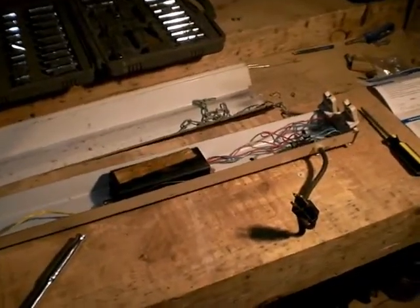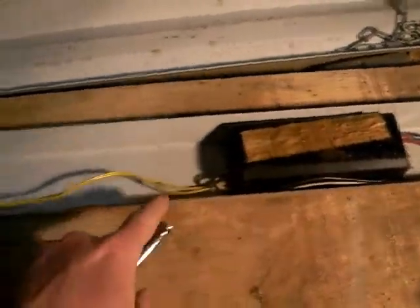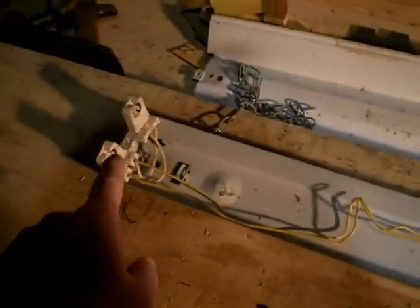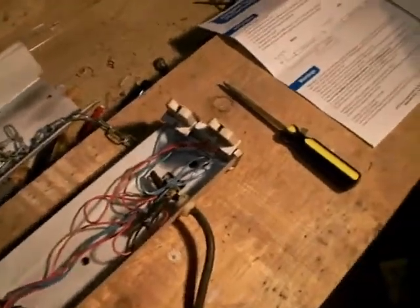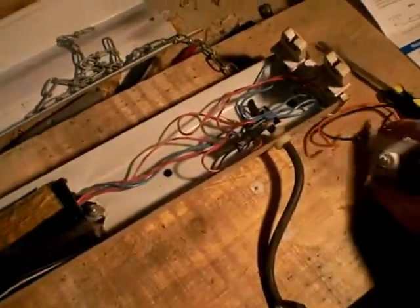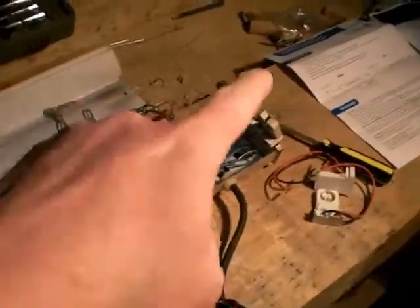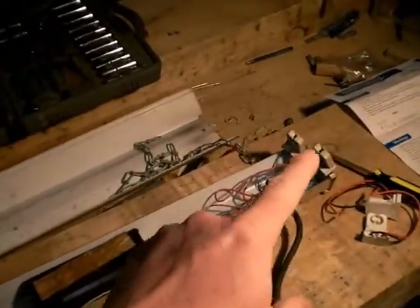So what's inside this fluorescent light? Well, not a whole lot. You've got the ballast and it's got a couple of wires leading down to these two tombstones, and then several more wires leading to the power and to the other two tombstones. Since it already came with new tombstone things, I'm going to completely gut everything out of here — except for those two, I'm just going to cut their wires — and eliminate all the wire mess.